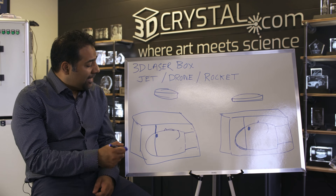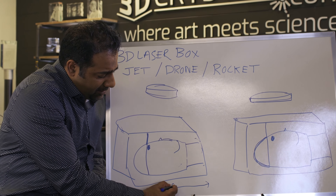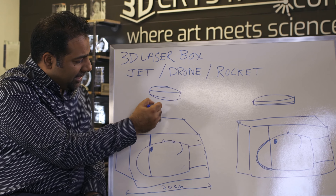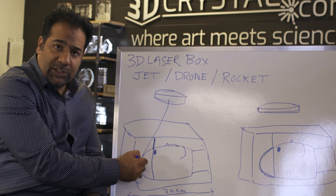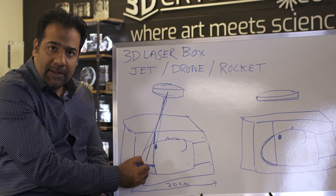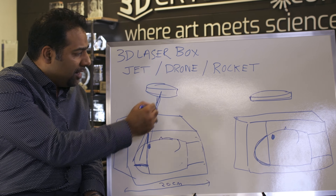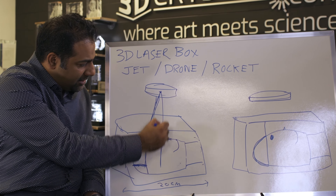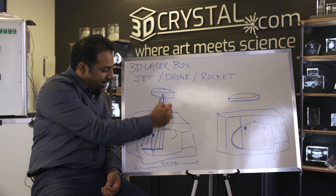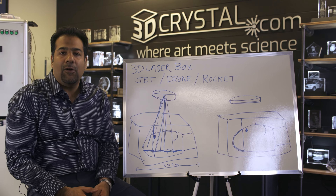What that means is: let's assume we've got a 20-centimeter crystal. The laser beam comes through the lens and goes to its first position. It then swings 5 centimeters across — that's its maximum reach. The table then needs to move over, and the laser continues to the next strike point — 5 centimeters there — then the table moves again, does the next 5 centimeters, and then the next 5 centimeters. That's essentially how it operates.